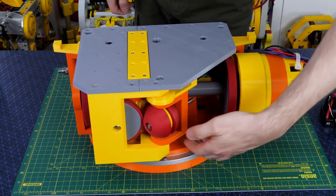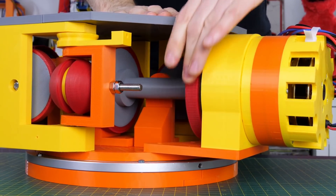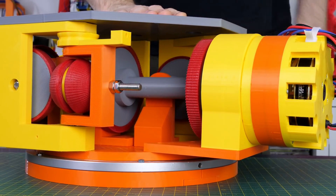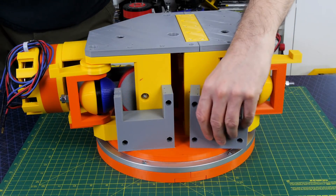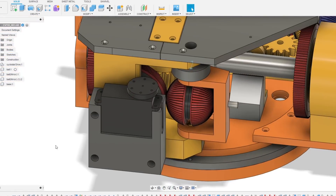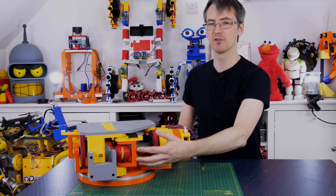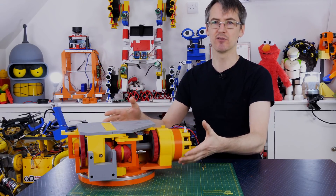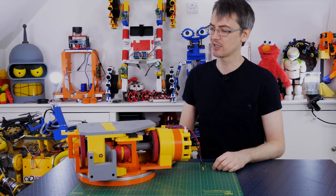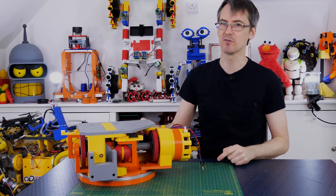So I'm pretty happy with how that's turned out so far. You'll notice the motor is wobbling as it runs and that's because the shaft isn't perfectly on centre and it's glued into the hub there on the output, so I could probably benefit from a TPU section or something flexible on that long grey shaft - I'll probably change that next time. Those balls are going to be driven on their vertical axis to control speed and direction by servos, so I've got three servo mounts there for some jumbo sized servos - the same ones I used in the previous CVT robot. It's going to be quite an interesting project especially when we get onto the control side, since we can control speed and direction for each axis, run PID against them, and then run inverse kinematics and interpolation just like the other robot arms and robot dog legs. Next time I'm going to be building the shoulder and the elbow axis which will come from these two vertical shafts driven off the two spare worm gears.